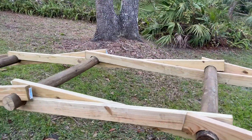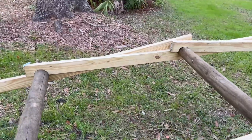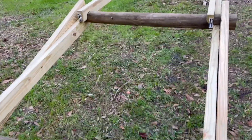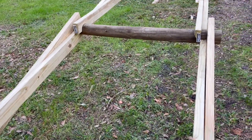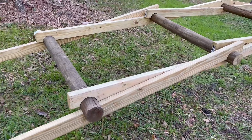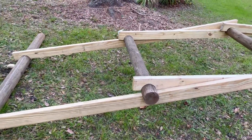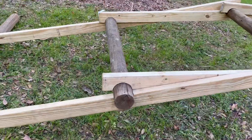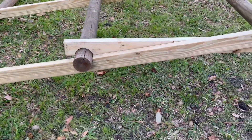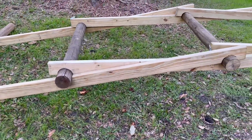The superstructure is pretty much done. What we'll do is add two by fours into the centers of each of these posts, and then I'm going to finish off the sides with two by sixes. They have to be high enough above for the decking to nail down flatly all the way across. I'll probably have to shave some of these down.